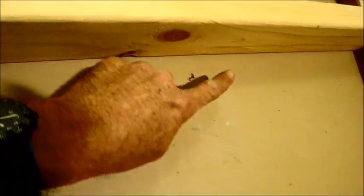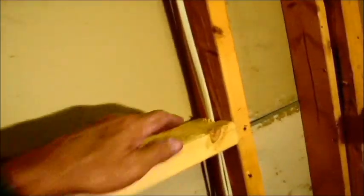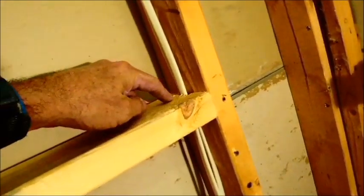Inevitably, there's going to be nails or screws on the other side. Yes, you're going to cause a little bit of a problem because you're going to pop that nail right through there, as I did with that one, and that's going to cause a little ding on the other side, but you have to do it when you take this out. So that's that. Then between the two studs, because I have wires in here, I cut out a little dado on both top and bottom, so I don't have to mess with the wires and rerouting those. What I'll eventually do, so those wires aren't part of my niche, is put in another 2x4 just off to the side of here so it'll encapsulate those wires and it won't be an issue. So it'll be about an inch and a half or so off from center, which it is now, but oh well, it is what it is.